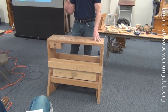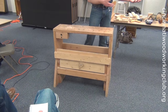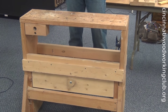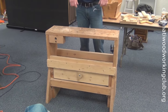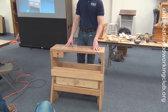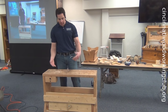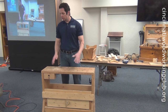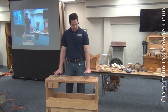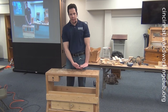This is my workbench that I take out on job sites. I found that when I'm out on a house and I've got to do some custom built stuff, it was really uncomfortable sitting on the concrete floor trying to cut things. So I wanted a portable bench, and this is just made out of some 2x12s. Now this is ergonomically made for my height — a workbench should be at the height where your arms are straight and your palms up, about 1 inch less.